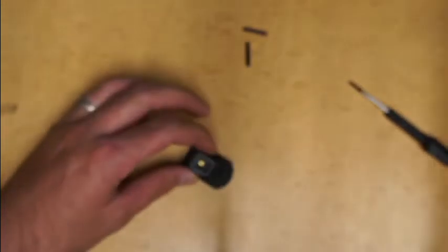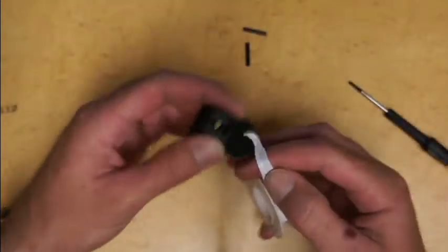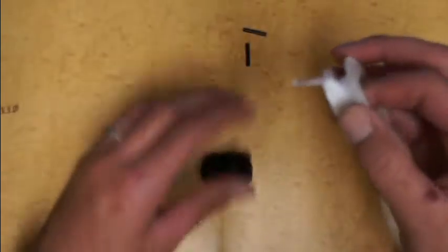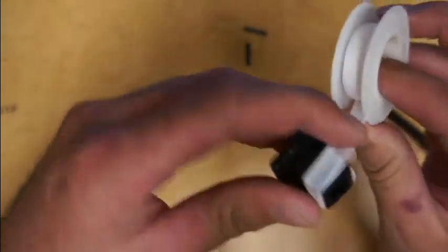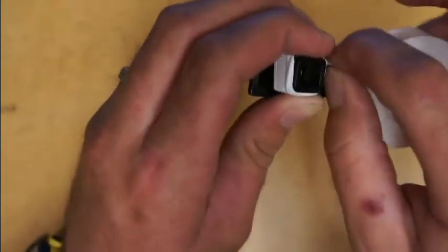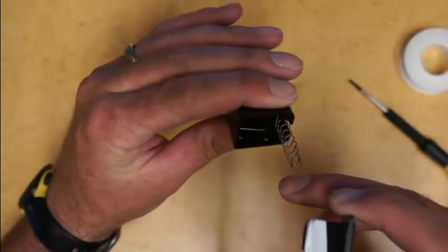The easiest way to fix the rectangle o-ring is with plumber's thread tape. I'm going to wrap this o-ring with the thread tape — real easy fix, real cheap, real simple. I usually do two full tight wraps on top of the o-ring. There it is — real simple, real easy. Slide it back into place.